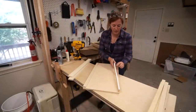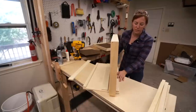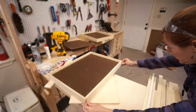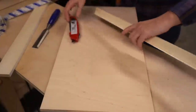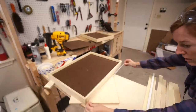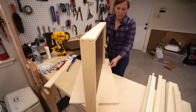On the outside pieces, only one side is edge banded, but the inside dividers are edge banded on both sides. Even on the trays, since the tray slides back and forth and both runners already have a slick surface, I'm going to put a piece of melamine along the bottom surface of the tray to make it glide just a bit easier. I place it roughly centered just to create a frictionless surface.